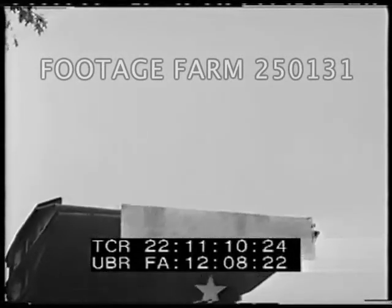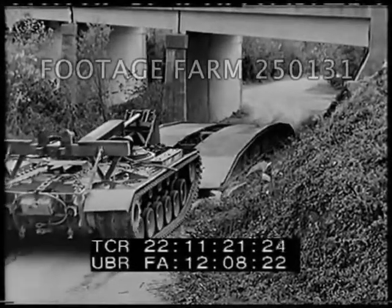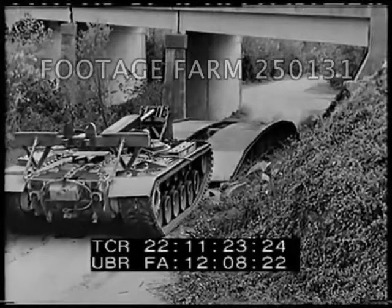The height, width, and overhang of the folded bridge presents a problem which must be handled carefully in passing through towns or villages. When the loaded vehicle is too high for an underpass, the bridge may be launched and pushed through on the roadbed.